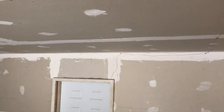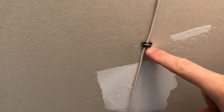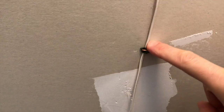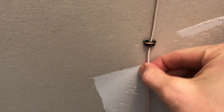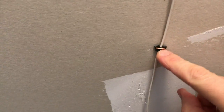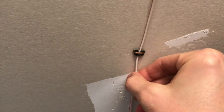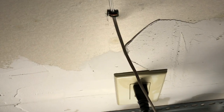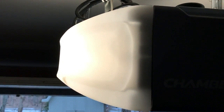Up on the ladder now. I've inspected all the wiring all the way up here. Every time you come across these little staple portions that secure the wire to the drywall, make sure there is a little bit of play, because the tighter these are the more stress they put on the actual wiring and they can harm or damage it. Feeding all the way to the other side, make sure the plug is properly plugged in and secure.